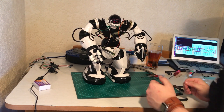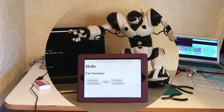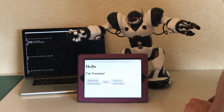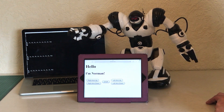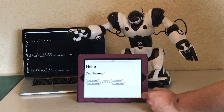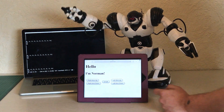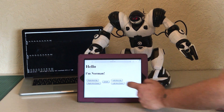So I'd done it. I'd taken a broken children's toy and landed a Raspberry Pi Zero inside it, and then given it a web-based remote control. You can see the prototype of it working right here. The code is very simple and most definitely not best practice, but it proves the point. And more importantly, it would probably work for any droid that can use Karl's robo.py. The IR codes are just sent over WiFi, so what we've built here is effectively a mini WiFi to infrared bridge.